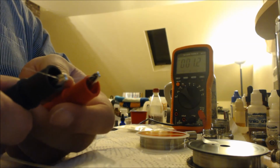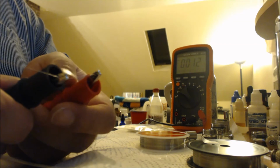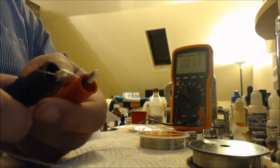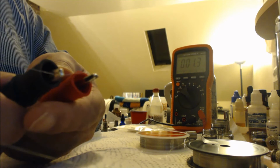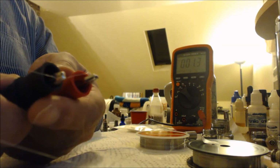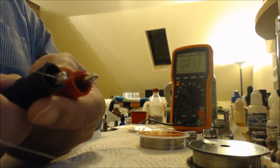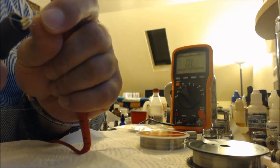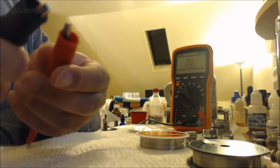Now what I do is on the side of, you see where it actually begins on my resistance wire, where the gator clip is. This side. This is how I'm going to bend it. See what I'm doing? I'm bending it gently. You see the ohms is still at 1.3. So where it's bent right now, that's the marker. That didn't come out too good. Let me do it again.